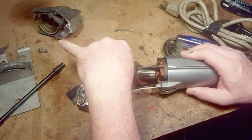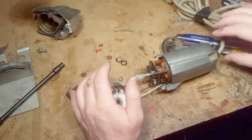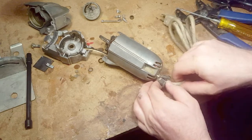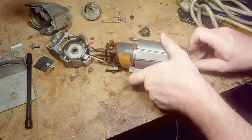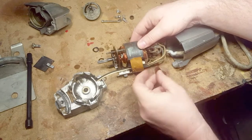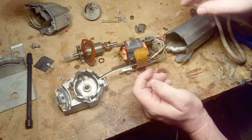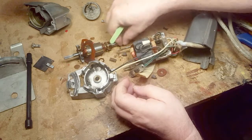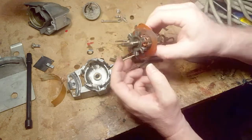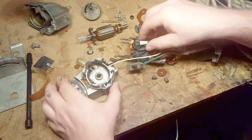There are little guards and clips you've got to keep an eye on. I've pulled the armature out but it's not getting me anywhere, because I'm going to have to loosen up the stator and take the cord out of the back. That's the strain relief on the wire, and that wire I'm going to have to replace because it's in pretty rough shape — it's a disaster. Those are the brushes — they fell out when I pulled the rotor out of the stator.